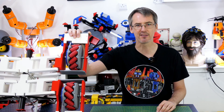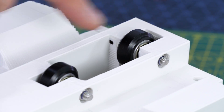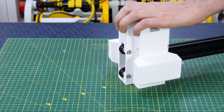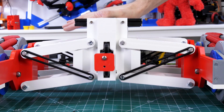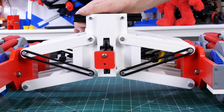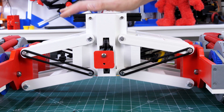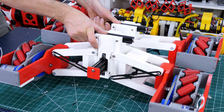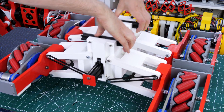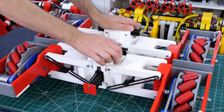Right, let's get the rest of this together. The central sections slide on linear rails — those have got V-slot rollers fitted in there and some 2040 V-slot extrusion fits nicely in the middle and slides backwards and forwards. My suspension arms link all of those sections together. At the moment I'm just using some bungee cord as suspension springs, but I'll need to replace that with proper springs in the future as the mass of the droid builds up and they'll need to be correctly rated. The four suspension arms allow the droid to lean backwards, forwards, left, or right — basically any direction by moving any combination of those arms — and that gives me quite a lot of motion, so I'm pretty happy with how that's turned out.